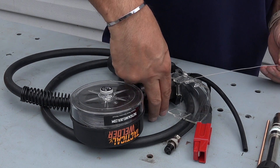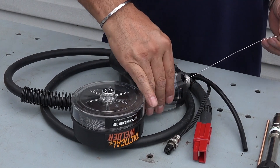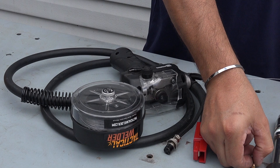Close the tensioner, then lock down the wire tension knob. Close the wire top housing. Apply an adequate amount of pressure to the drive roller by turning the wire tension knob. Adjust the spool holder tension with the retaining nut as needed.